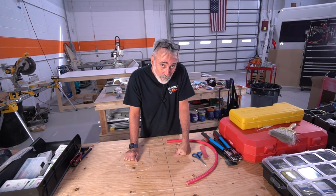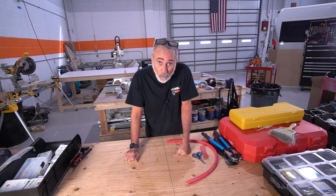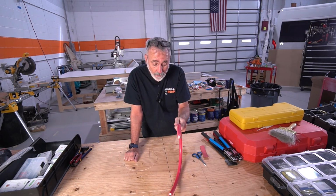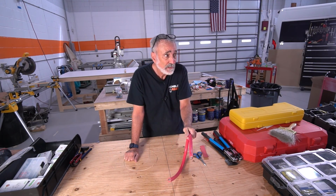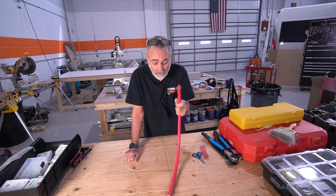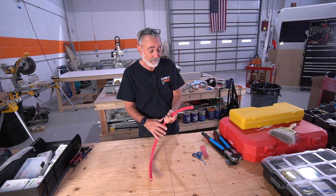You know, a lot of van builders are getting bigger and bigger battery banks in their vans, and they're going to need bigger and bigger wire. And 4-aught is what I use. 3,000 watt inverters, 630 amps of lithium. I use 4-aught cable. Doesn't matter how long the run is. This is where I'm getting the most bang for my buck.